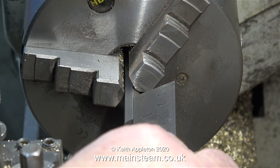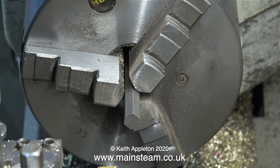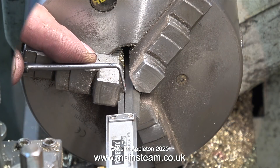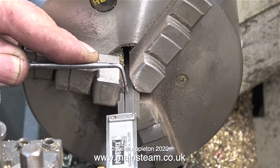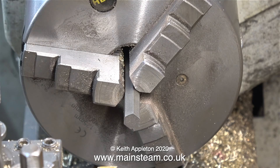In this clip the stainless steel is in the chuck, and I'm just making sure that it's in the right position. All I have to do now, in a multiple of four because I'm making four bolts, is machine part of this stainless steel down to 3/16ths of an inch in diameter. Let the turning begin.